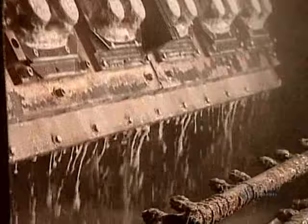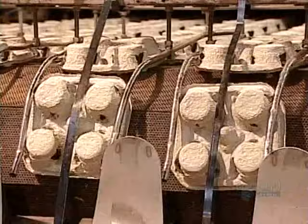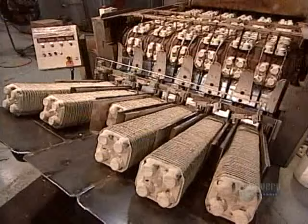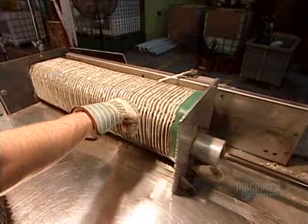The factory uses the identical molding process to make four-cup drink carriers. These also go into an oven to dry out the pulp, but only for six minutes — half the time the filler flats need — because this product is smaller and lighter. Automated compactors then stack the finished drink carriers, and workers compress them for packing and shipping.